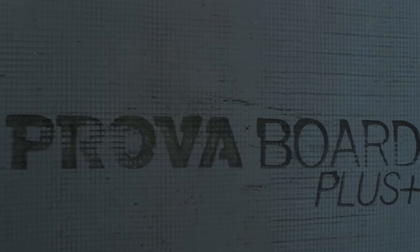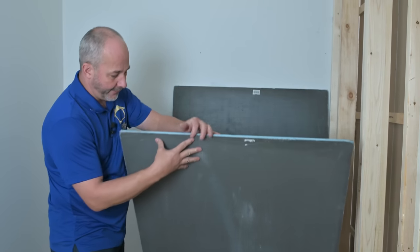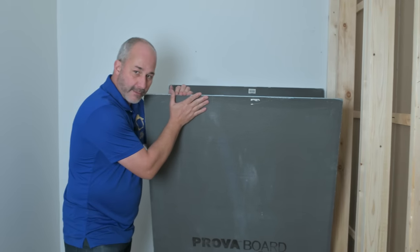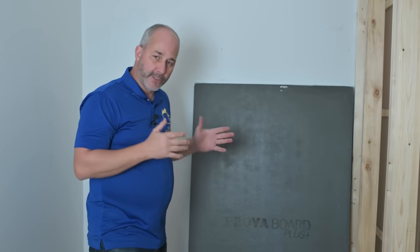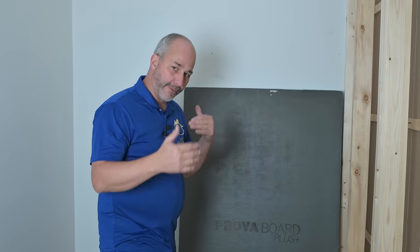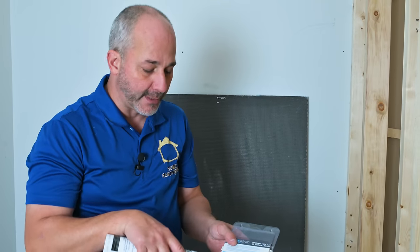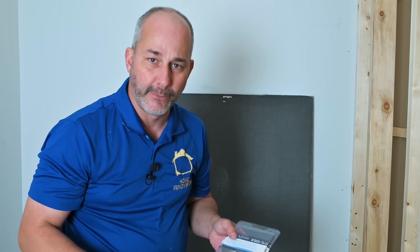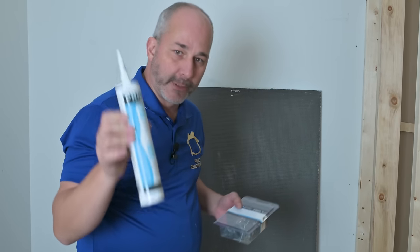In the world of construction, everybody who innovates is replicated. This is a foam board core with a mesh surface that's covered in a cement finish. It's completely waterproof. You can install this almost identically to the way you install Schluter products — you don't have to change a whole lot of technology or skillsets. You can buy the tapes, the screws, and the screw system with washers is exactly identical to what's going on with the Schluter board. You can buy the sealant to do all the joints.